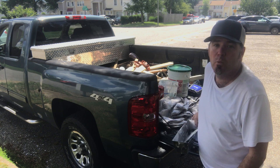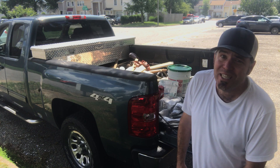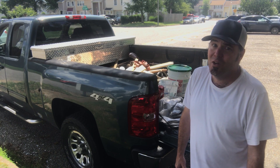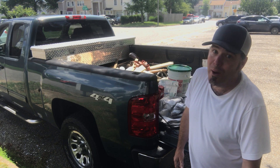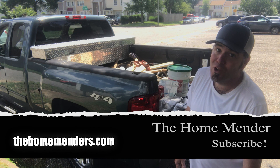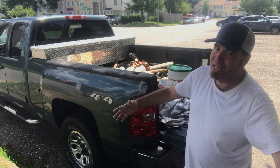So that's it — had the bathroom ceiling cave-in, wasn't as bad as you thought. Pulled that fallen ceiling out, built down the drywall, put the new ceiling up, trimmed it out in bed mold, skim coated the walls. All you need to do is sand it and paint — I'm going to leave that to you. Let's face it, you've got better things to do than standing around watching a sanding video. For HomeMender, I'm Dustin. I hope you learned something today, and if you did, don't forget to click subscribe. Thanks for watching.